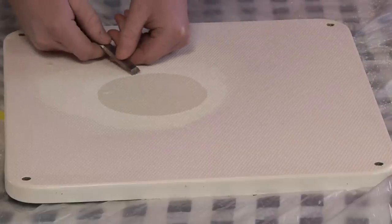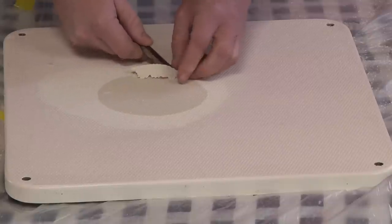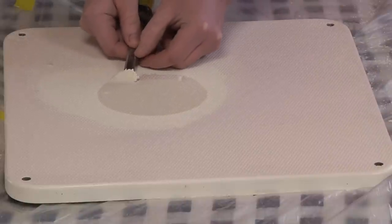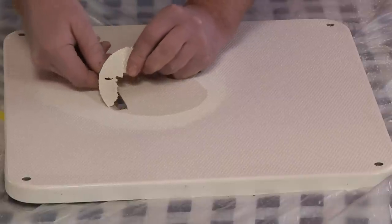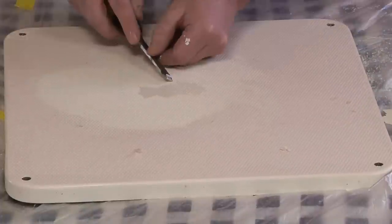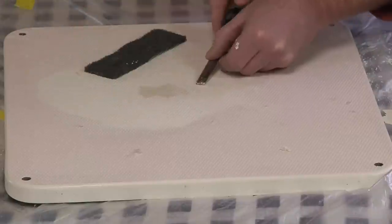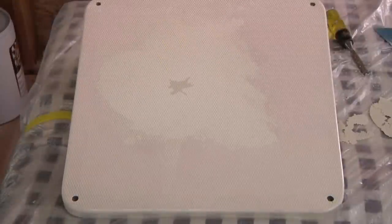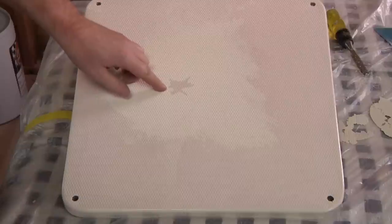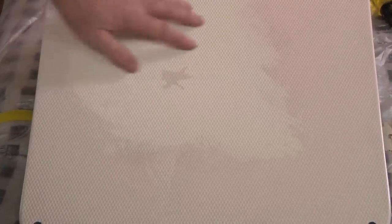Let me go grab some water to wash off this PVA and then we'll be able to see our print a little bit better. All of this excess gel coat that basically got squeezed out when we put the mold down — this was laid right over top of PVA. So if I can find an edge here, this should just chip right off. After a little bit of picking away at the edges and getting all this excess flaked off, it turned out fantastic. The pattern in here is spot on and it's aligned with the surrounding area.